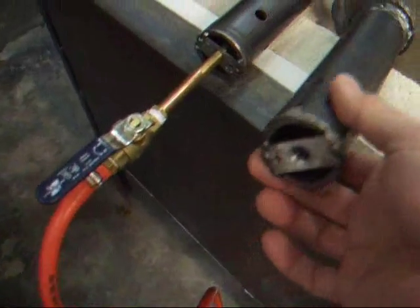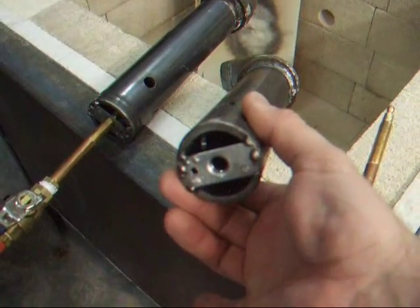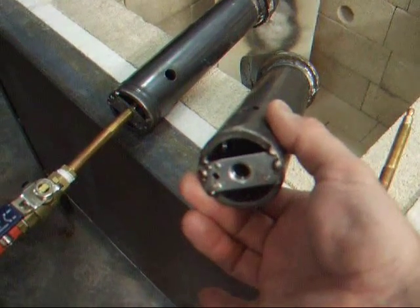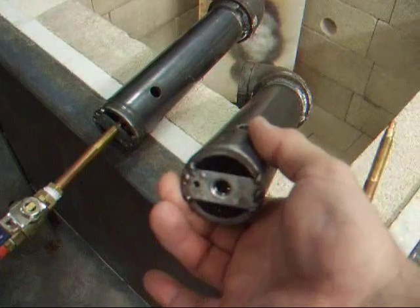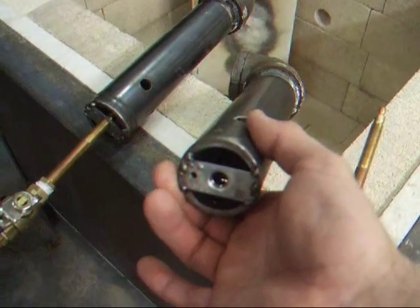Now, the other burners I made — what I had there was, if you remember, a 1/8-inch plug that you threaded in there. It was threaded from the inside. I actually got that plug out through these holes. What I did is I made a different system so I could put different size orifices in and do it pretty quickly.